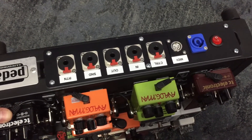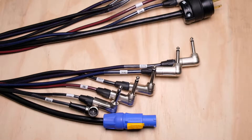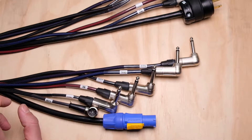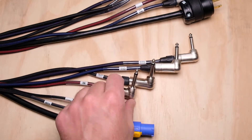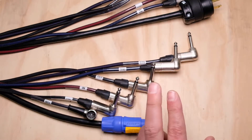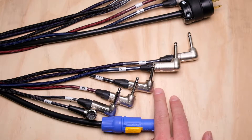Here we have the cable I built to go with the board — I have a plug for every jack on the back panel. This is from btpa.com, their CA1003 multi-channel snake cable. This is great for performance rigs and pedal boards. There are a total of seven different cables inside the snake. First, you get four standard channels of unbalanced audio — 24 gauge, oxygen-free, pretty low capacitance at only 20 picofarads per foot.